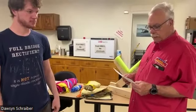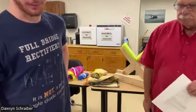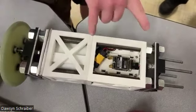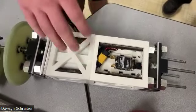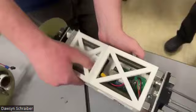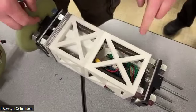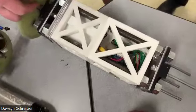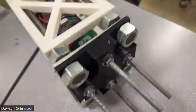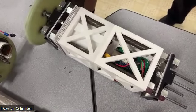so tell me a little bit about what is in the nose cone, the electronics, if they are attached during flight, and the batteries. Yeah, so what's in the nose cone is the payload, which is right here. It's a 3U CubeSat. Like flight wise, all it's really got that's relevant is GPS or SRF GPS. So we got a transmitter here. On the other side, there is a BeagleBone little microcomputer, and then a GPS chip right there. And it's also doing some other data collection for the payload challenge, but for rocket safety wise, all that we really care about is the GPS. It's a redundant GPS beacon, and transmits there.